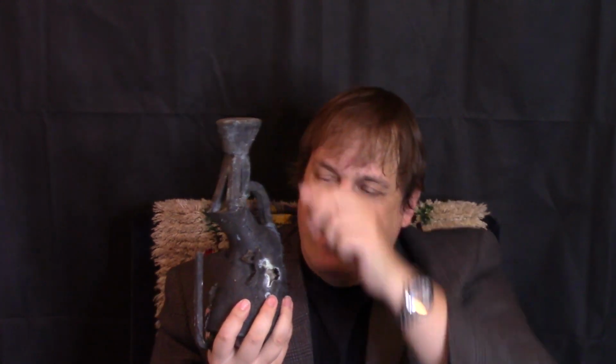However, we see, despite the fact that there was a sprue at the join of the ear to the body, because the ear is a small projecting area of the statue, this part did not fill completely. Here is another example. In fact, it's the example from this mold, and because it was thin, there was no problem in the metal filling out this entire piece. As you can see, the projecting areas like legs would have to be sprued so that the metal would flow easily between these. There were several other places where channels were made to expel air, but these have not survived.